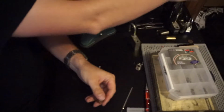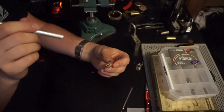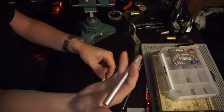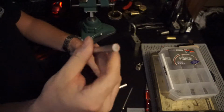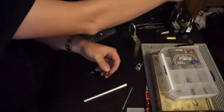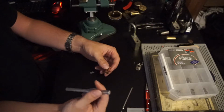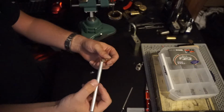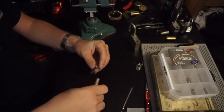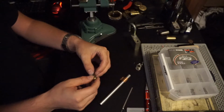And then if I grab the right follower, just take a follower. I know this is smaller. My normal follower for doing American lock cores, another homemade one, went from 1/2 inch down to 7/16. So normally this is what I use. It's too big for these because I leave 1/2 crimped. This is 3/8 round aluminum stock, and just follow it through. Just that slight difference in there is what makes it work. Alright, yep, number 3 didn't have to be picked at all.